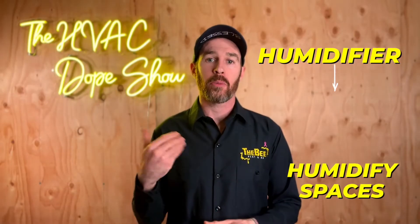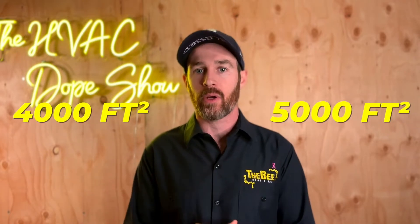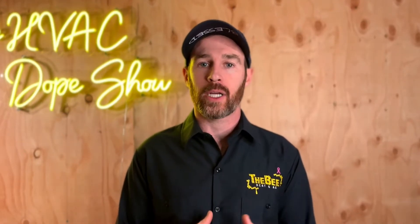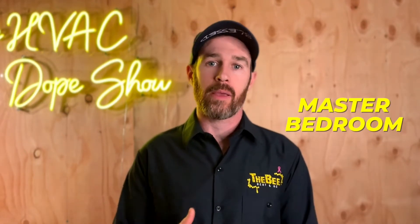The Aprilaire 800 is not a system you just plug in — this is a heavy duty whole home humidifier that can humidify spaces up to 10,000 square feet according to what they advertise online. In my experience, even on the highest settings a steam humidifier will work well for a space up to about 4,000 or 5,000 square feet max. If your space is larger than that, you might need a second system, although you can often just put it on the system that services the rooms you want to humidify most — for example the master bedroom or main living space.